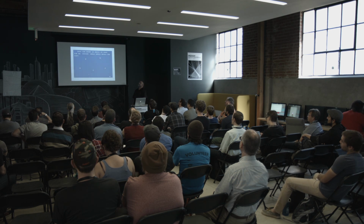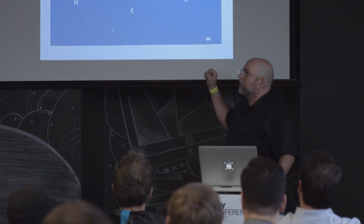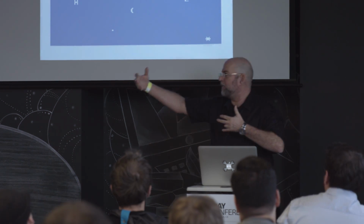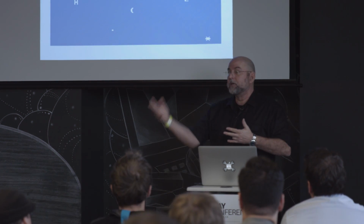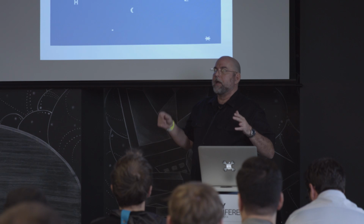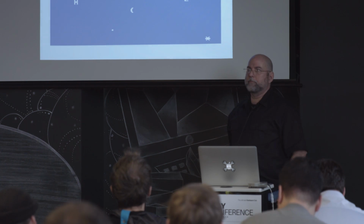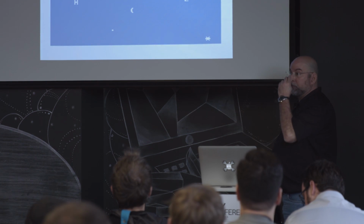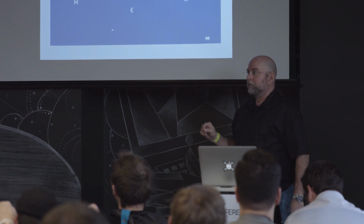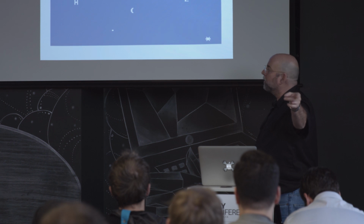And it's like, okay, look, it's a memory corruption. When you say 0, I'm going to ignore you, okay? We'll still be friends, but the thing about a memory corruption is here's a VIC chip on a bus, here's a Z80 on a bus, they share the signals, here's a 6502, sharing the signals with the ROM, shared signals. They're jumping on and off, the DRAMs are going, well, give me some, give me the rest, I've got it. Anything in that can corrupt the DRAM. It's the scariest thing. I don't remember being scared, but now it's the scariest thing that can happen to you because you don't know when the corruption occurred. It's like somebody threw a bunch of crap in the road, and an hour later you hit it and you get a flat tire. Well, the problem isn't that you hit it. The problem is the crap in the road an hour earlier.